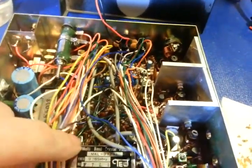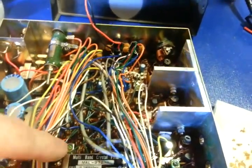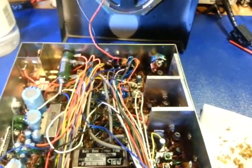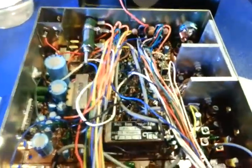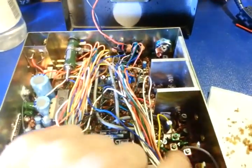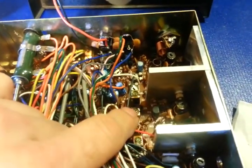So I'll have to remove the transformers and get those cores removed so I can adjust them. Because right now, with being broken in half, as soon as you stick in a proper alignment tool the cores just split open — the harder you turn, the tighter it gets because the core is split down the middle right where the screwdriver slots are. The proper way to get these cores loose without breaking them is to use solvent.